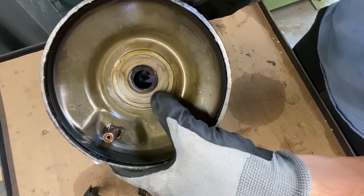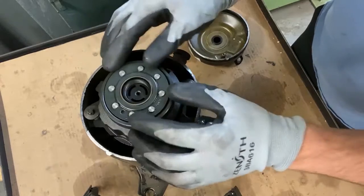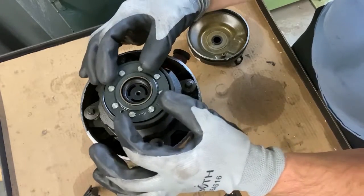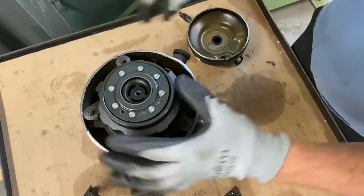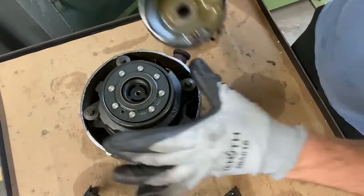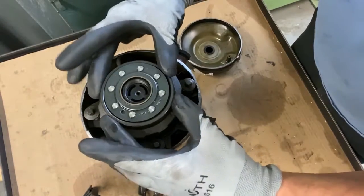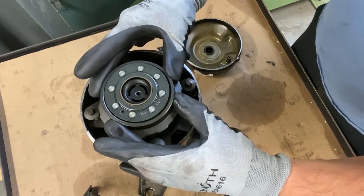Okay. And then this is the floating seal. This is where everything happens, like I talked about. This floating seal has pressure coming from underneath it to balance this out. It pushes this up against the muffler plate, because this is the muffler plate, so it can push down the fixed scroll or stationary scroll so they can engage the flanks.